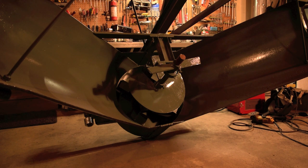I've got the auger and the blower assembly installed in the snowblower. I replaced both pillow block bearings on it, got brand new bearings in there, and I've got the PTO shaft ready to go. The two universal joints have been replaced, and I added a coupler that's got a shear bolt in it to protect the PTO shaft in the tractor.